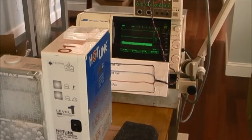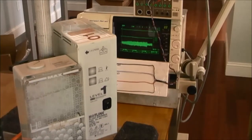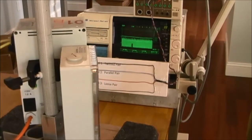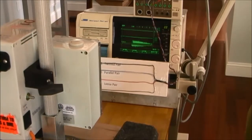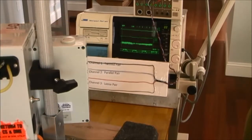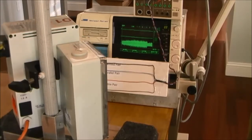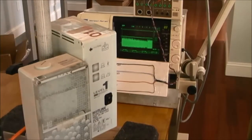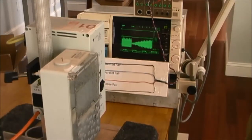Many of us know that this is a directional electrical field, which is demonstrated as we rotate the fluid warmer. Our electrodes show that this is a directional field, but it's quite clear that the twisted pair and ribbon pair reject this significant 60-cycle artifact better than do the loose pair.